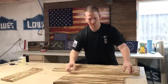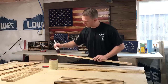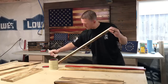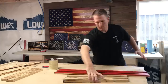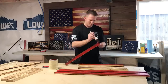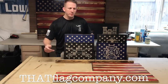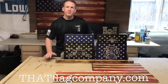We're doing red, so we'll pick out our best stripes and stain them. Notice I'm flipping the wood over and staining on the inside of the stripe — because sometimes the wood can push out, and you want that red showing instead of bare white wood. This helps you make a more quality flag with less noticeable discrepancies. The stripes are stained, so we laid them out for a quick preview of what the flag will look like once assembled.